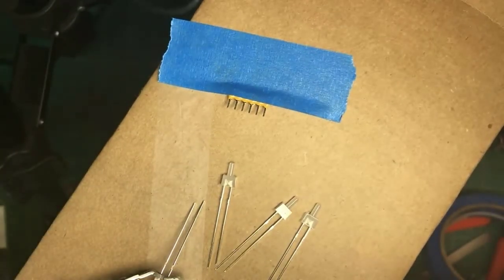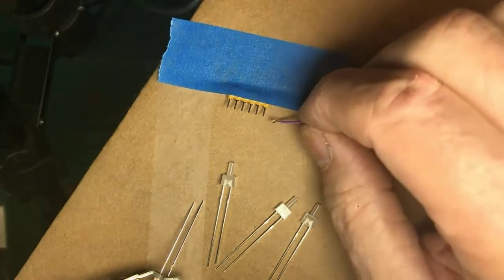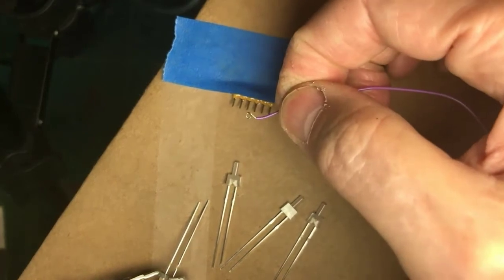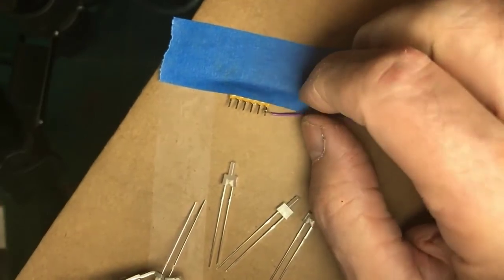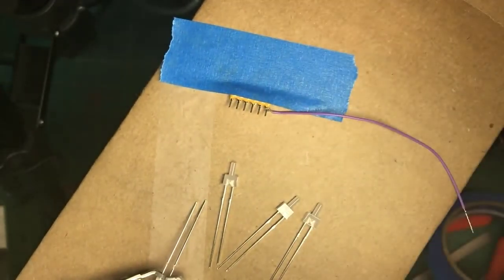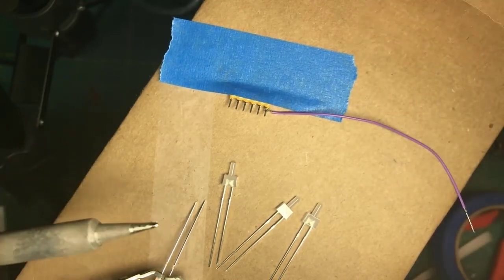And so now I have a collection of 1,000 ohm resistors that I want to connect to our LEDs. And so here we go. I just took a tinned fine wire. Actually, it's a leftover piece of decoder hookup wire, and I'm going to connect it here. And this is where, again, providing a better mechanical connection by turning that wire into a loop. Okay, checking my camera.